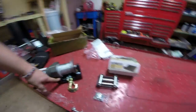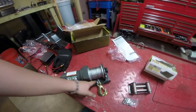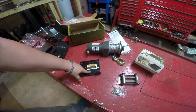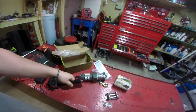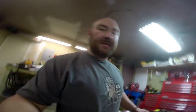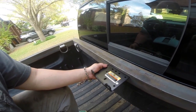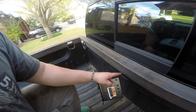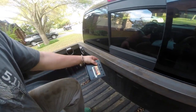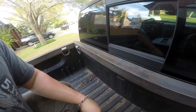Here's our winch setup — that's the next thing we're going to focus on building. We're going to build basically the frame that our winch is going to sit on. Harbor Freight sells this winch plate for like five bucks and it makes mounting these front rollers a lot easier — the winch just bolts to this plate. We're using this hole right here and this hole right here. Basically we're just going to weld this onto our bracket. I'm thinking it'll sit just a little offset because we have to be able to use those two sets of bolt holes in the middle, running our two-inch tubing right here, flush with the bottom of this piece.